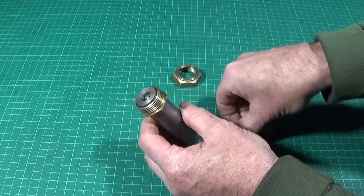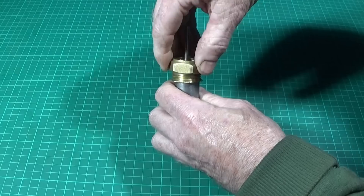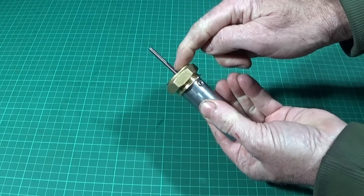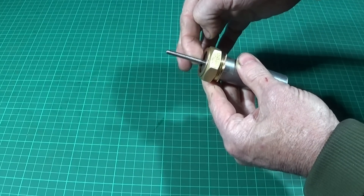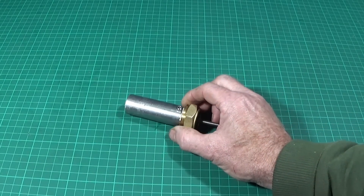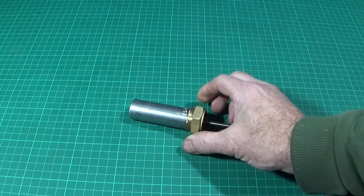This particular mandrel is to hold screws like Allen screws, and it can hold them in a collet chuck so that you're able to remachine screws — you can shorten them, or turn them down and recut the thread with a die to make smaller screws. It saves you from having to make up more complicated fixtures like lantern chucks. These are really quick and easy to make — you could make them in under half an hour.